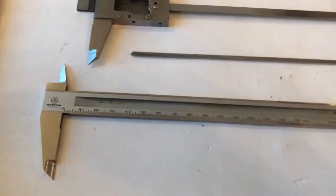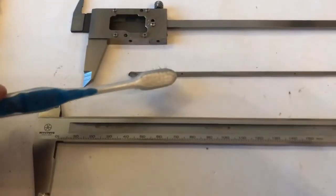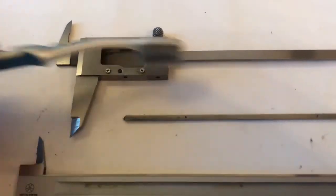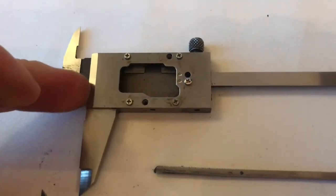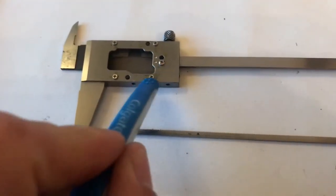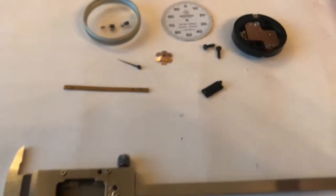I'm going to clean this up. I've got a toothbrush — dip that in a bit of thinners and go down there gently and clean it all up. I'm going to brush it side to side, and then probably try and push a rag down there to clean the channels. Just to repeat: I would not undo these screws because they've all been ground to a perfect finish. If you undo that, there will be slight movements and this will not be in exactly the same position. So let me get cleaning — I think the main problem is in there.